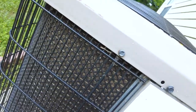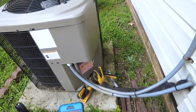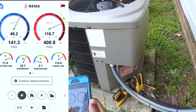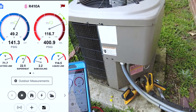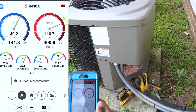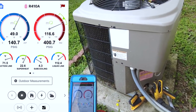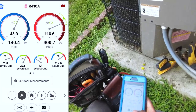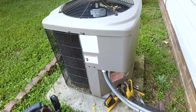That's a dirty coil. It's one of those micro-channel coils. Let's see if you can take a look at how dirty that thing is — you can barely tell, but it's pretty dirty. And you can actually see by the liquid line temperature there — it's 114, so it's not rejecting enough heat. It's got slightly high head pressure, but it's mostly going to show up as a higher liquid line temperature and reduce your sub-cooling. That's why you've got reduced sub-cooling.